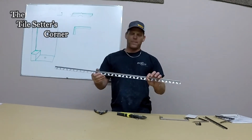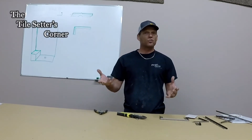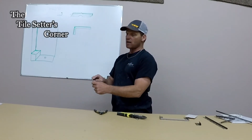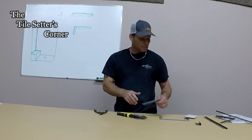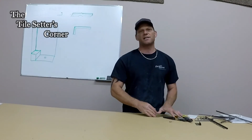Like I said, a softer metal is the best for bending because it won't crack. Bend Guard will crack. You can use Bend Guard as long as you're not bending it, and if you want to do the miter cuts with your chop saw — I just find that takes a lot of time. Still looks nice, but bending is also a nice finish. I'm Joe Deezer, Red Seal Certified Tile Setter. Until next time, see you later.